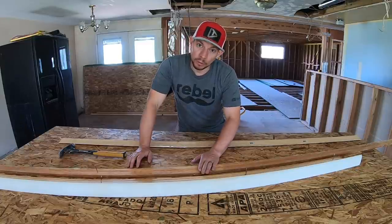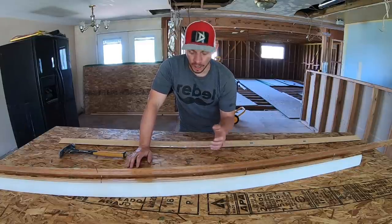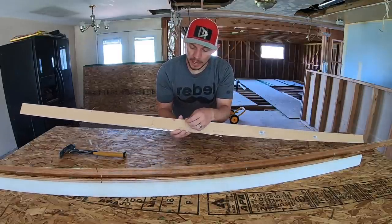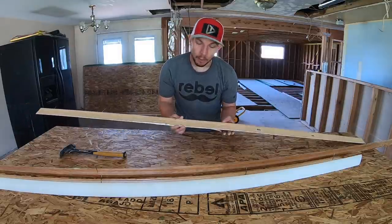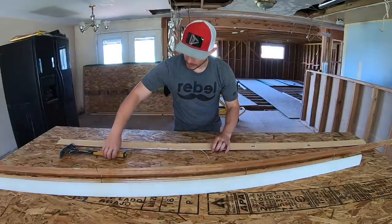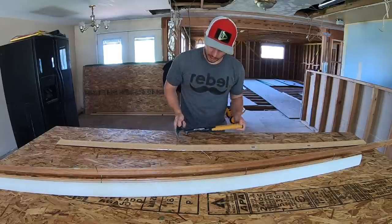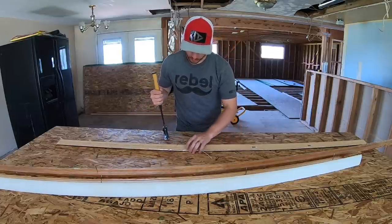Nails pull really easily out of real wood because it just functions a lot better. This piece is fiberboard and it's put on with brad nails — a pin-style nail — and this is most likely what's in your house if it's a newer home. I want to remove those the same way, because you'll never be able to dig at a brad nail and get it out. The hammer trick doesn't really work here either because they're a little too thin — they don't have enough body to them. Sometimes they'll go, but not reliably.